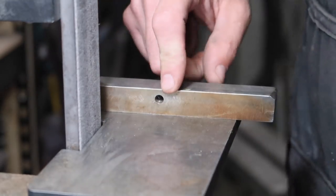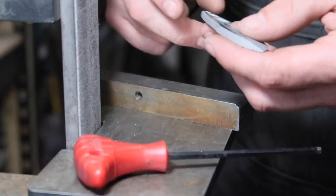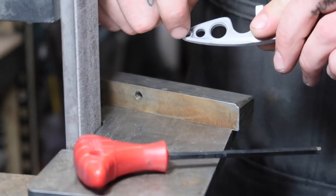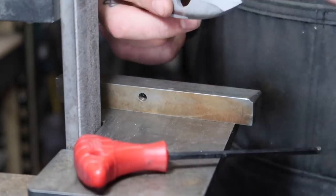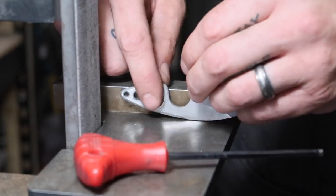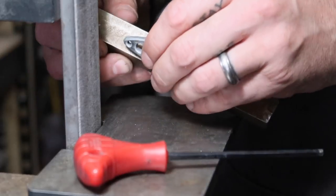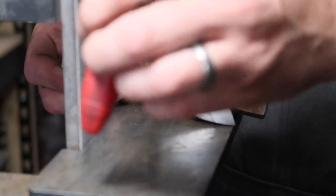So some of you might remember this little grinding jig — I ground the bevel on it that matches the specific bevel I like to use for these little knives. I put the bevel on before drilling the hole, so this is a quarter-inch hole here and a bigger one there. Now that it's drilled, I want to clean up the bevel after heat treat. To solve the problem with the hole, I took my lathe and machined a little brass adapter that pops right in — a really precise fit — and voila, I'm back to using this jig to finish off the bevels.